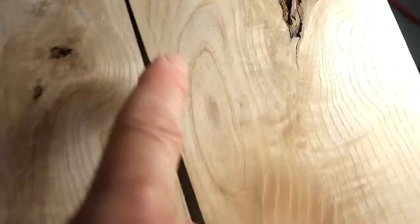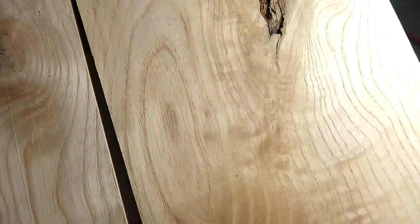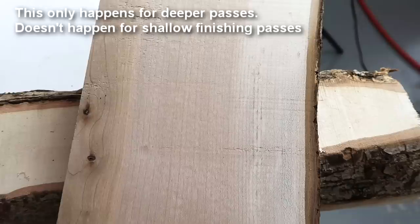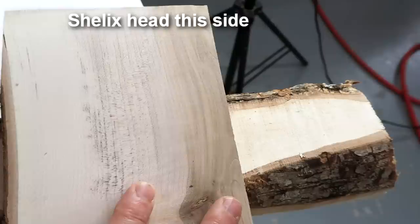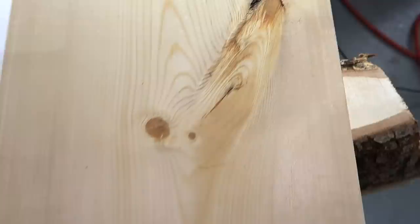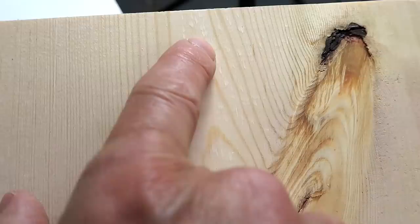Possibly some of these little cutters on the Shelix head weren't perfectly aligned. Here's another comparison — we can clearly see the line from the nicks, whereas on the Shelix side there's much less of that and fewer lines from the knives, and both are quite shiny. There's some tear out with the old head, and on the whole surface a little bit of speckling — I think that's from chips getting caught between the knives and the wood. That's a problem with my jointer, not so much with a straight-knifed head. But on the Shelix side we see none of that defect, and even with difficult grain it's nice and smooth. Here's some spruce — there's some small bits of tear out near the knot and a little bit of speckling from chips getting caught between the knives.